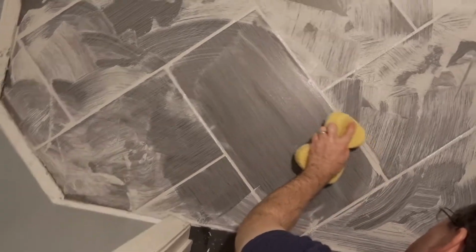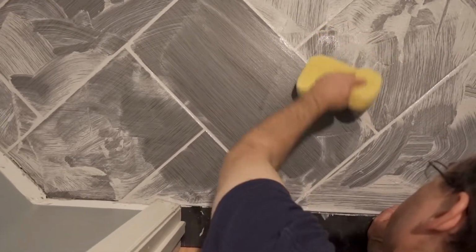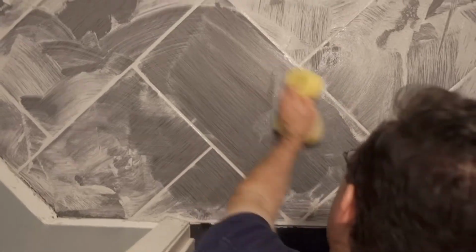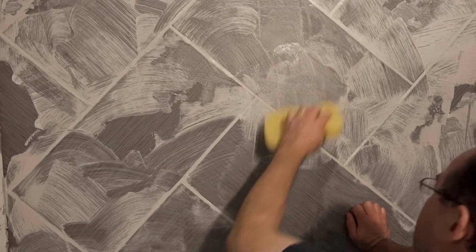What about like that? Because there's still plenty on this, again, go at your 45 degree angles, and because there's gunk on the sponge, it will wipe off into the grooves as well. So these are very rough cuts. As you go, you get cleaner tiles, and you start to flip the sponge over and go to the other side.